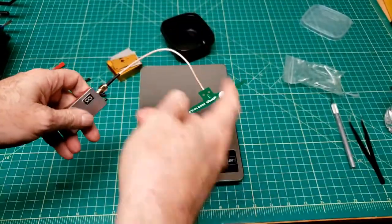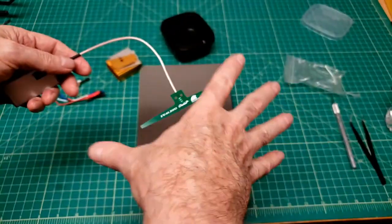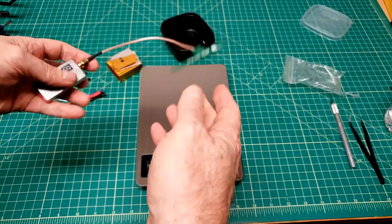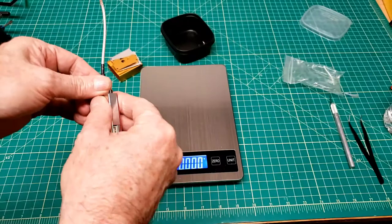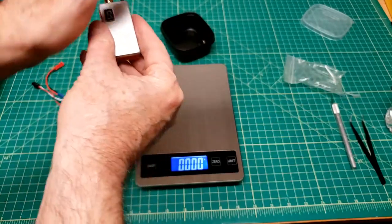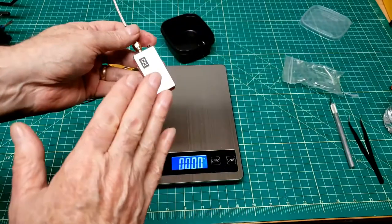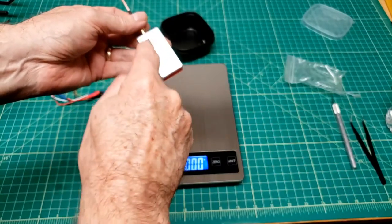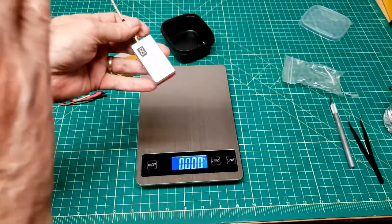This is part of the electronic, what would you call it? It's like a component. The way that this antenna is tuned, its impedance, its resistance, its capacitance to the final output amplifier in a transmitter is part of the circuitry, as if it was a resistor or a capacitor. It's needed. It really is. Without this portion, that appears to be some resistor, some capacitor, some inductor, or a combination of any of those, to the transmitter, if it's not out there, the final output amplifier in here will start reflecting power, and it produces heat. Produces all sorts of other electrical problems.